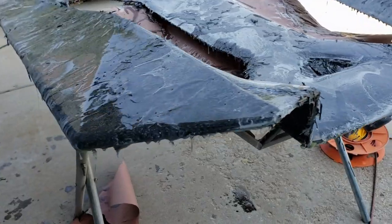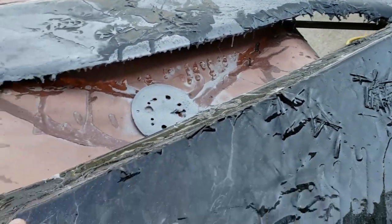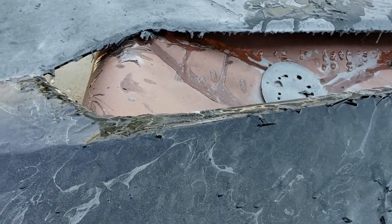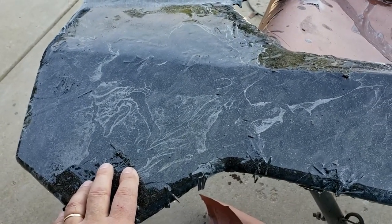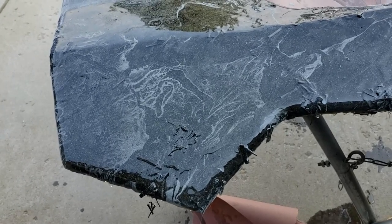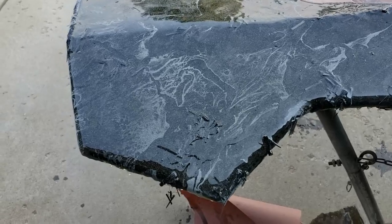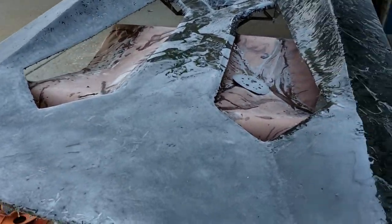What we're doing is sanding it down. You can see all these little rough spots — these are where I'm basically repairing some of the issues, like fabric sticking through. We put a little bit of epoxy in the area, wait for it to get tacky, then stick down some chopped carbon fiber and cover it in thin epoxy to help saturate the material so that when we sand it, it doesn't come off in fuzz. I've got maybe half of it sanded, then we'll put another layer of epoxy on it, hit that with 320, and hopefully we'll get to clear it — that will be determined by how much ash we're getting from the fires.